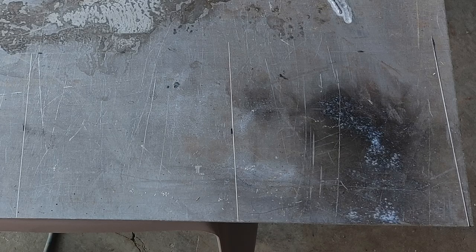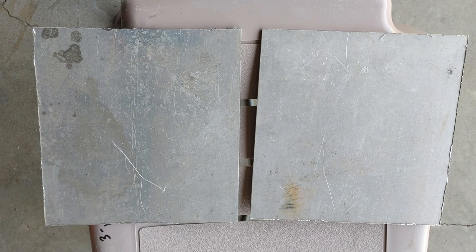For the mounting plate material I happen to have some eighth-inch thick aircraft aluminum. You can use heavy gauge aluminum like that or steel, and in the lower right you can see that I have measured and marked off the two pieces for the upper and lower bracket — to attach to the seat and then to attach to the swivel. Here I've got them cut out using a four-and-a-half inch angle grinder with a cutting wheel. I forgot to mention you'll also need a hacksaw or something to cut your mounting plates if you have to make them.